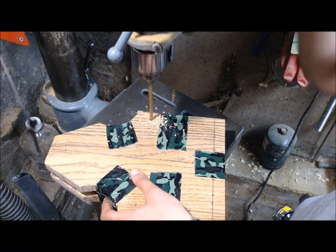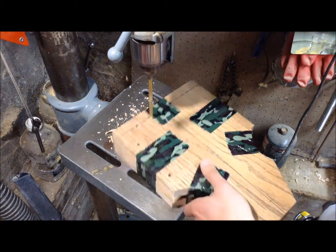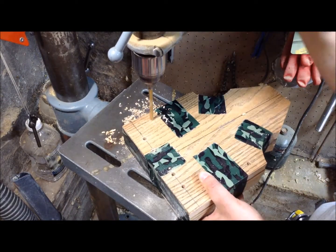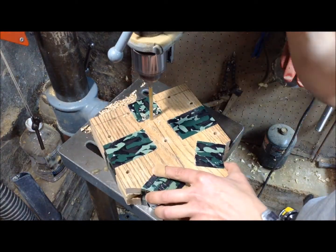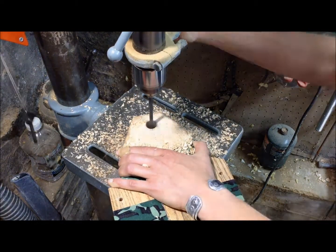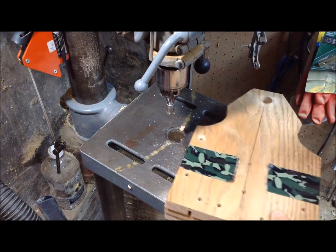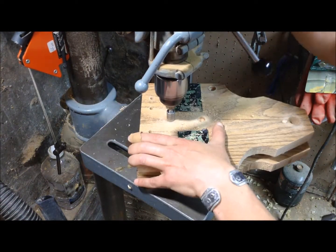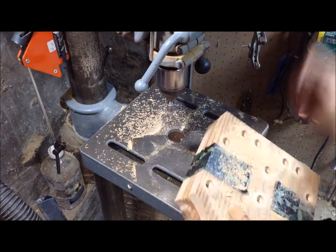Then with my drill press, I used a 1/4 inch drill bit and drilled out all the holes in my piece straight through all 4 pieces that will hold all the threaded rod. I used a 3/4 inch spade bit to drill out the holes that will hold the conduit for the handle. Then on either side of the 2 sides I used a 1/2 inch countersinking bit and test fitted the nuts I'm going to use to attach the threaded rod so that the nuts sit recessed on both sides of the piece.